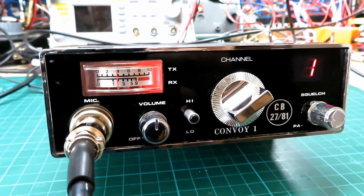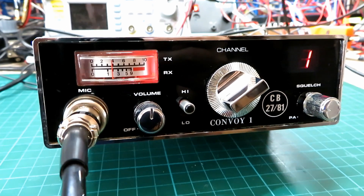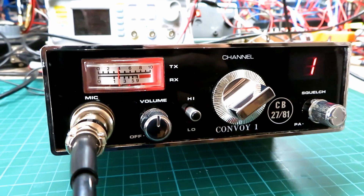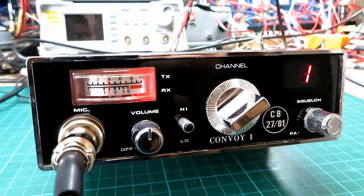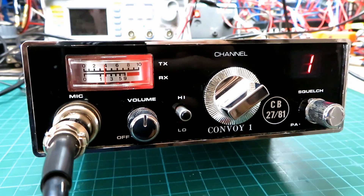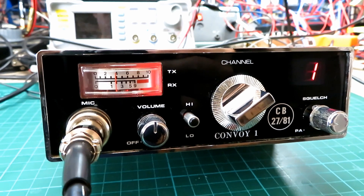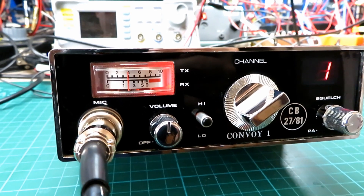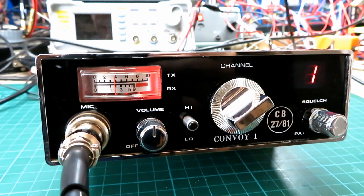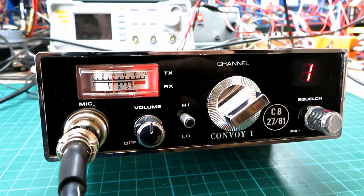Thanks again Mick, I appreciate you taking the time in your busy schedule to help test these radios. Sometimes with the mic gain thing — I had the deviation looking all right, but because the mic gain was set too high I didn't realise it was clipping. It's really nice to have someone to test against — that's why we always do this, to get them absolutely spot on. Thanks for watching and keep an eye on the channel for more repairs and some ham radio stuff coming up. We'll catch you on the next one — take care.